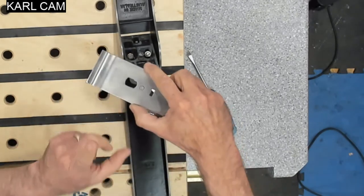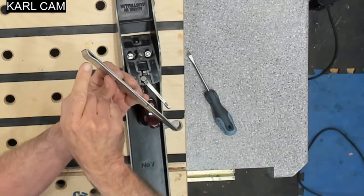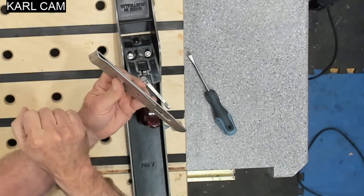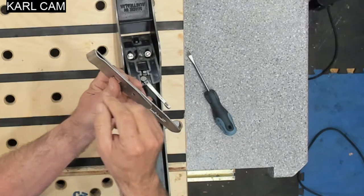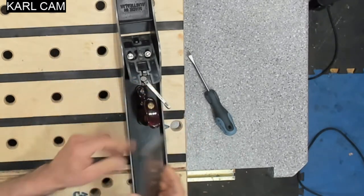The backing iron has got this bump on it. Now, there's two reasons. One reason is to push down hard against the cutting edge, and the other reason is to start the curls of the shavings happening so that they nick off out of the way for you.